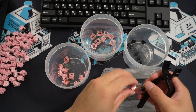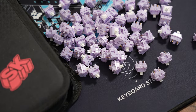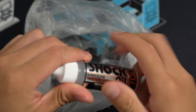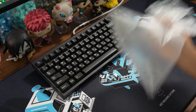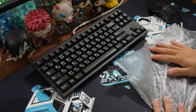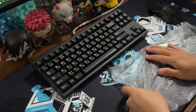I'm going to show you guys how I lube my switches. There are many ways out there — I don't really enjoy lubing and I'm pretty lazy when it comes to this, but this method works best for me. After I take all the switches apart, I use shock oil to lube the springs — I blob the bag and give it a good shake. I then lay it flat and rub it in for a bit, then repeat this process another time.